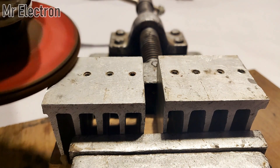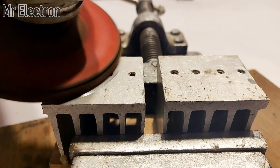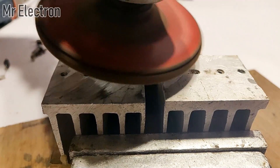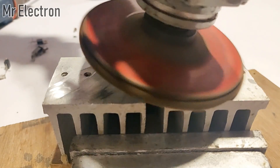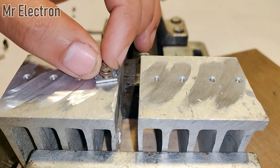The circuit contains two transistor sets, and each transistor has a job of switching on and off one of the sides of the transformer. The output of the transformer is AC, which can be converted to DC with the help of a bridge rectifier. Also, the surface of the heat sinks should be completely leveled for proper heat dissipation.